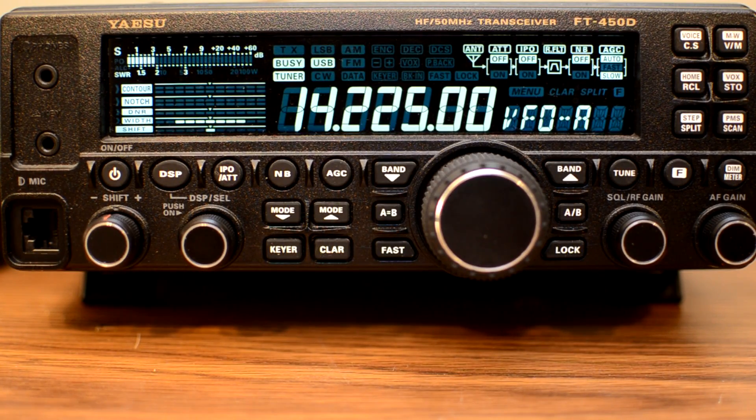So we'll go ahead and start with the contour feature. The contour feature basically will notch out or peak up a little part of the IF filter passband. These features in the IF stage work a lot better than the audio stage, and that's one of the nice things about the DSP. This can help suppress or enhance a little part of the passband. You can shift it around to figure out where in the passband and how much you peak or null it. A lot of it is just trying it out on signals and seeing how it sounds.